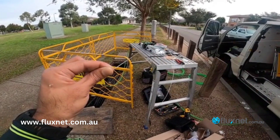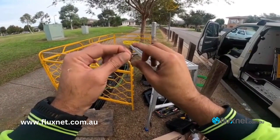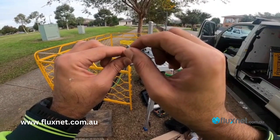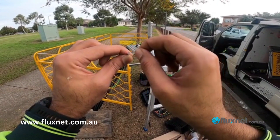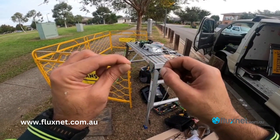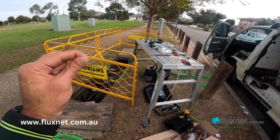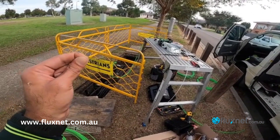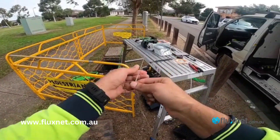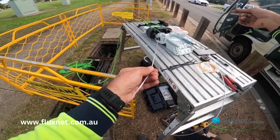This one is orange. Now you're only left with the blue fiber — the first one, the last one. What you've got to do is hold the coating so it doesn't break away; that way the fiber comes out clean. Keep a little bit of tension on the coating and just take the fiber out up to the mark.